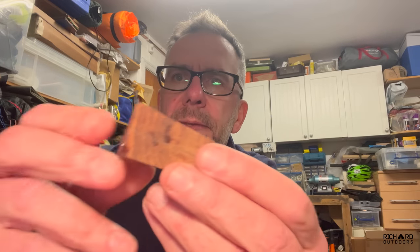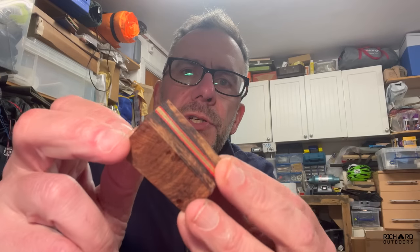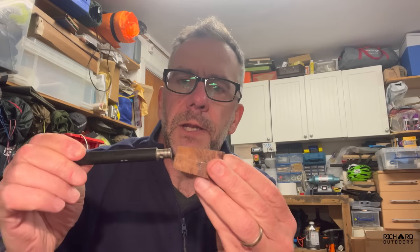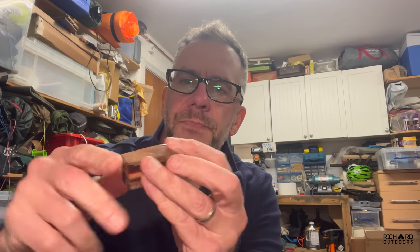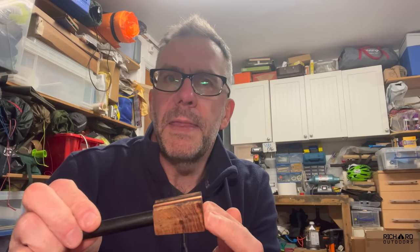It's another day, another jumper. This is now glued in place and what I'm going to do is go through the various grits on the sanding belt. I want to get the face here up to show standard, because once I've put the ferro rod in and glued it, it's going to be very difficult to get in there and get the finish I want. I'll knock off these hard edges with the belt grinder and then glue the ferro rod in place before beginning the hand sanding.